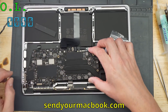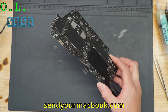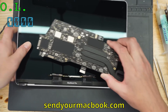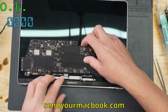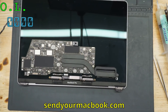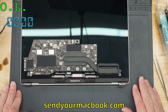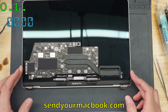There are some good suggestions to look into from our last video. Some of the good suggestions were that maybe something's wrong with the backlight that's feeding back into it. But there are more sensitive things on that line than those two ISLs. So I don't know if it's the backlight feeding back into it or not — we're still looking into it, still trying to figure it out. It's a good discussion in the comments below.